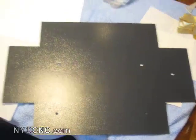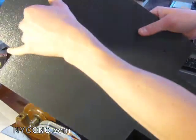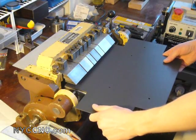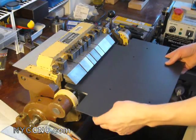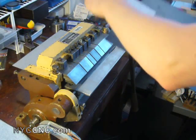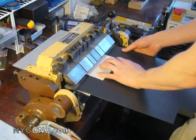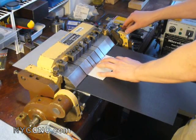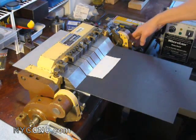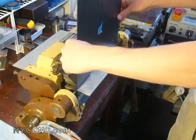This is what I had to deal with at my home shop, so let's go ahead. I have to start with the 6-inch bend — this is 6-inch, this is 12-inch. One shortcoming of these style finger brakes is that although you can do a 12-inch bend, you can't if there's any material sticking out on the side. So that requires you to start with the 6-inch. I just take a regular paper towel, set it over there. I've already adjusted — these two fine adjustment screws are nice for your workpiece height, so I eyeball it to get it close and lock down my piece at the stop gauge.